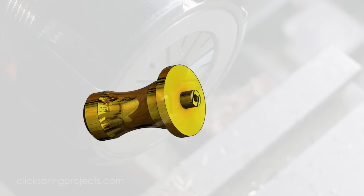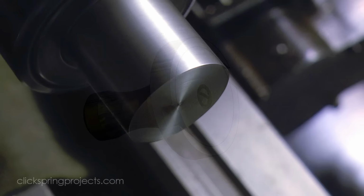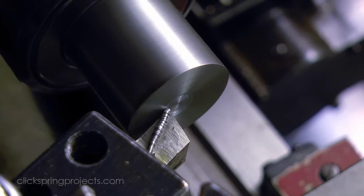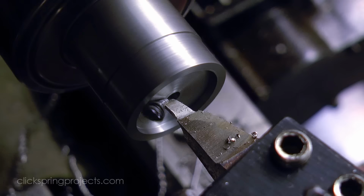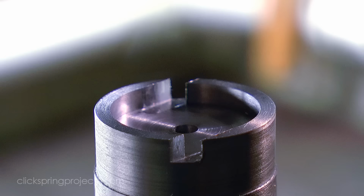For a flat spiral spring, the tool used to form the springs generally looks something like this. The small recess within which, in this case, two springs are to be wound defines several of the spring's characteristics. Its inside diameter limits the amount of material that can be drawn into the space. The number of openings through which to draw in the wire defines the spacing between each of the spirals. Two openings permits two pieces of wire to be wound together, and so the space between each spiral equals the thickness of the source wire. Three openings winds three pieces of wire together, and so the spiral spacing becomes twice the thickness, and so on. This effectively determines the length of the spring for a given recess diameter and wire stock.